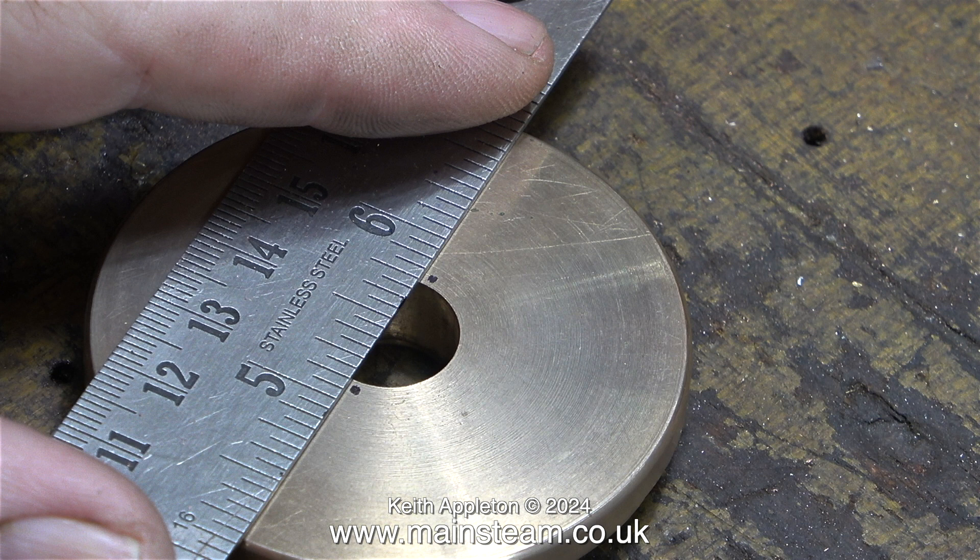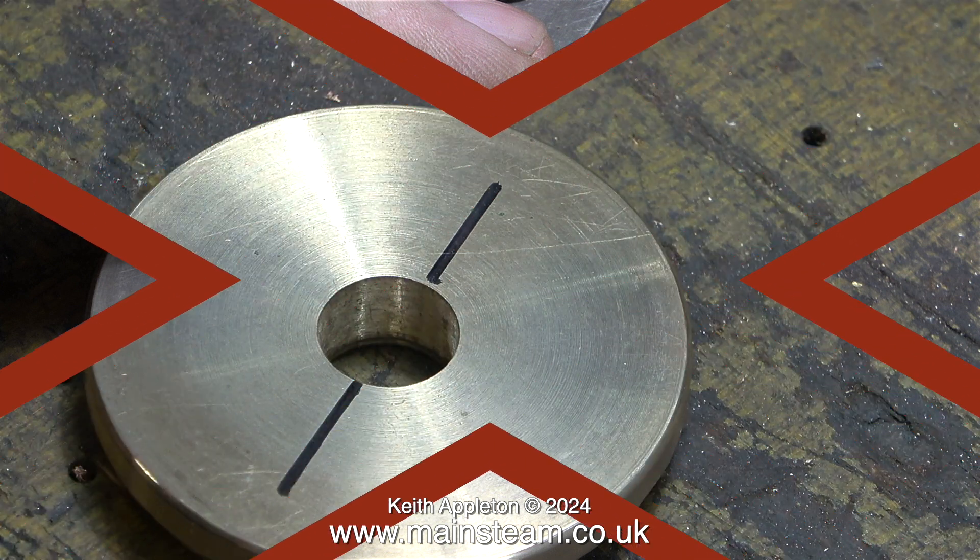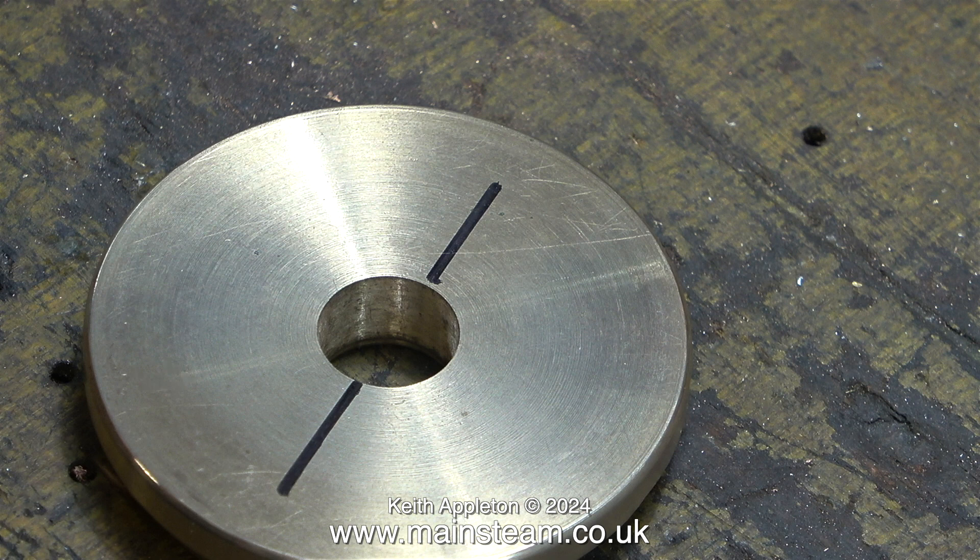I'm going to start with the wrong way to do it. Using a felt tip pen I put two dots either side of the center hole in the top cap, and I think at the time — possibly owing to the drugs that I'm taking — my calibrated eye wasn't quite so calibrated as usual. The marks were close to the center but not close enough. When I drew a line across the marks you can see that the line is not in the center at all.